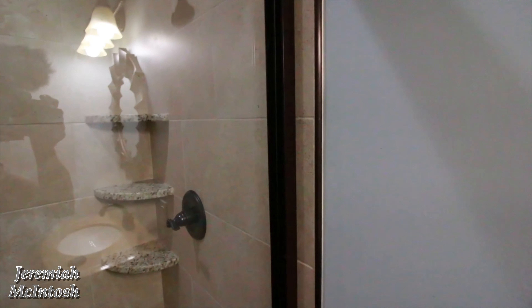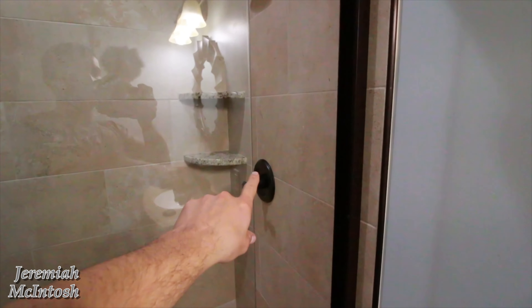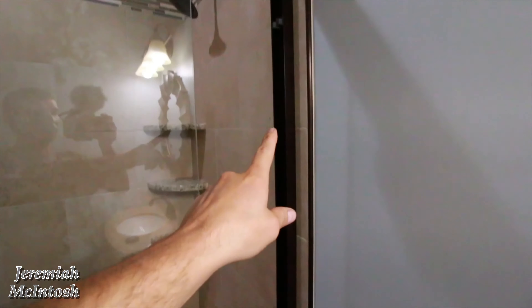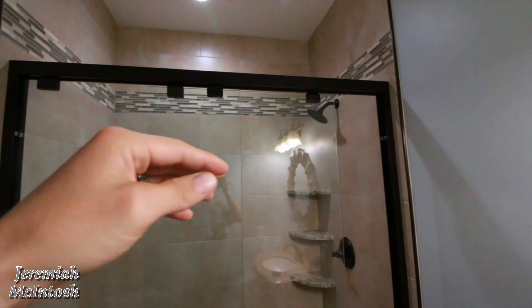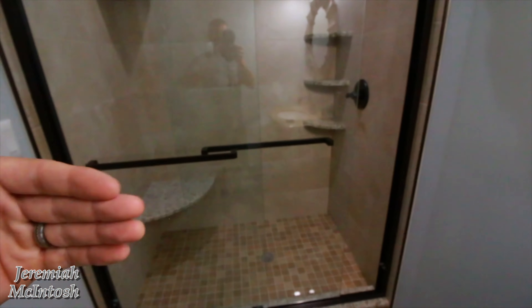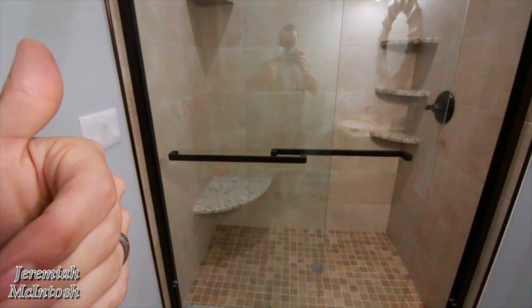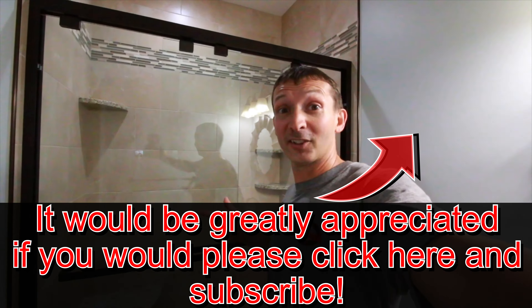The only difference between frameless and semi-frameless: with semi-frameless, the glass itself is frameless — it doesn't have a track around the glass, that's what makes it semi-frameless — but you do have a frame around the door on top, bottom, and inside. With fully frameless, you just have the top track and the door glass, with some guide on the bottom or usually one fixed panel and one that slides or pivots out. Thanks for watching — hit subscribe, click the bell for notifications, thumbs up if this was helpful, and please share.